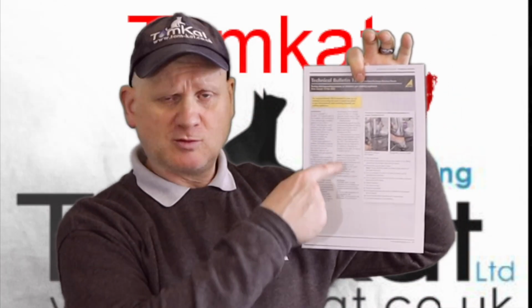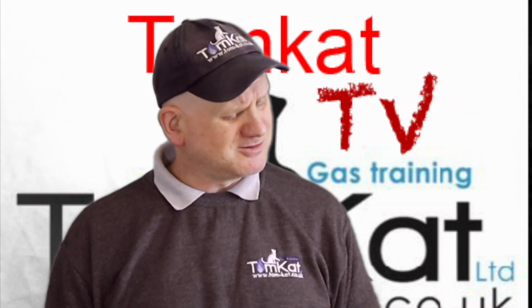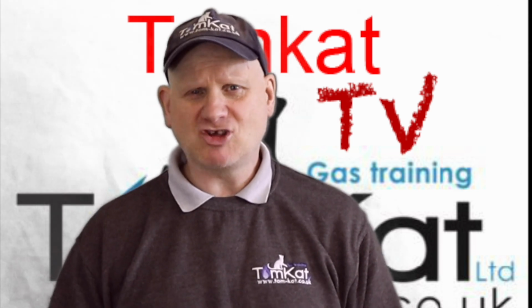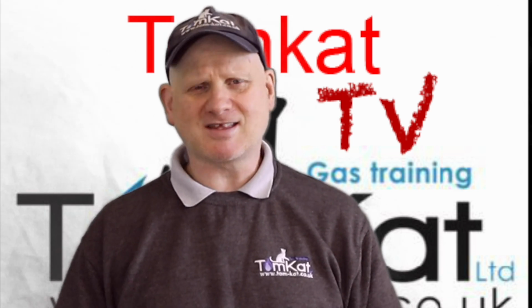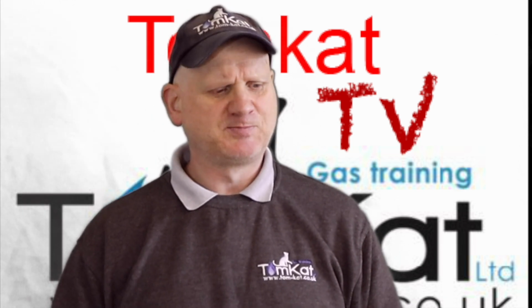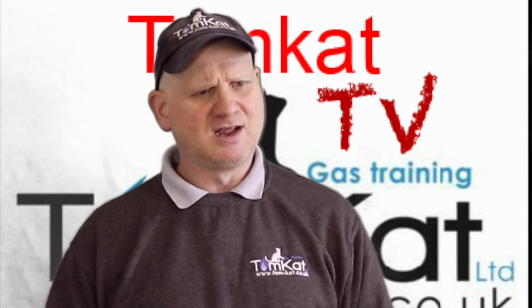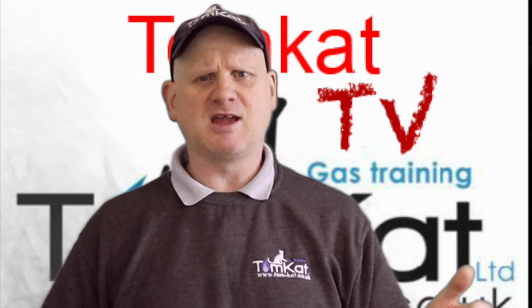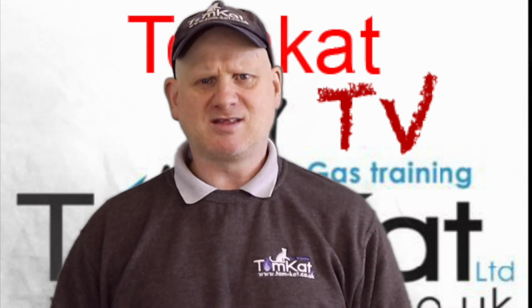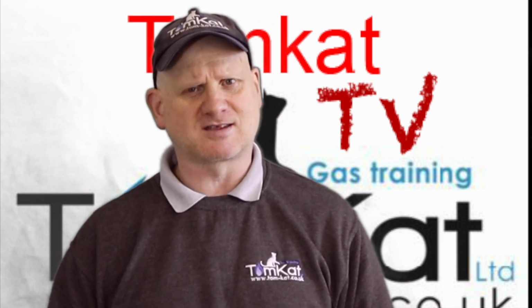Now, Technical Bulletin 161 will give you all the procedures we've just done. Now, do I deem this test necessary? Well, if I'm doing LPG and I haven't got a gas meter, then yes, I could have to do this test. But if I've got a gas meter there, and the flame picture looks good, and the gas rate's good, and my working pressure at the meter's good, and if I operate a boiler nearby and it doesn't affect the flame picture, then do we need to go to the dangerous situation of doing this test?